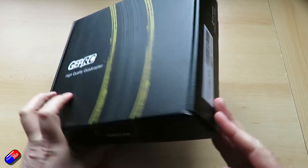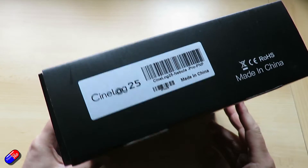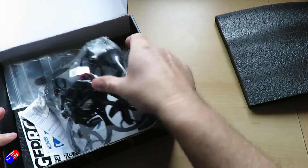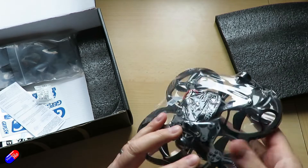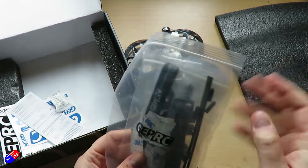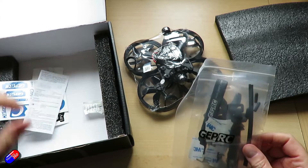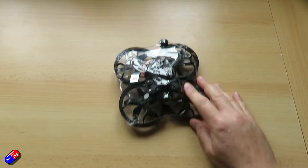So this is how it comes in the box. This is an F4-based flight controller with 20-amp ESCs and the new 1204 3750kV motors with 5-bladed props. We have the quad ready to rock and roll. There's a bag full of bits including a spare set of props, the different pads, stickers, and the manual for the DJI Caddx system. It's the Nebula Pro on here, which is good — so it's going to be a lovely image.